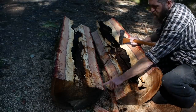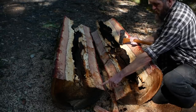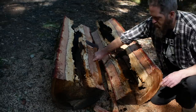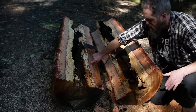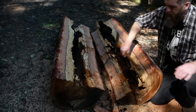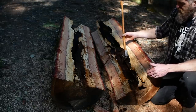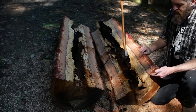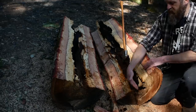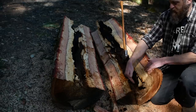There's a lot of discussion about grain orientation lately, whereas before you almost never heard anyone express a preference for grain running the other way. In terms of how this tree is laid out, there's about three-quarters of an inch of really white new sapwood that's not that strong — I want to get rid of that. I don't have much width here, so if I oriented it with the growth rings going the other way I wouldn't be able to fit axe handles in. Going this way I can — and that's how I want them.